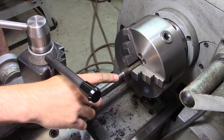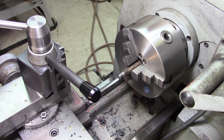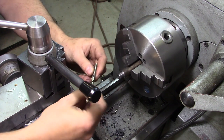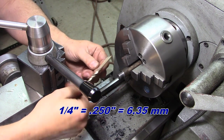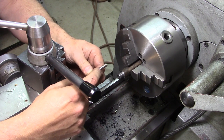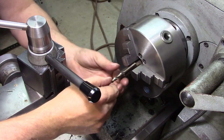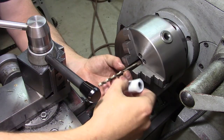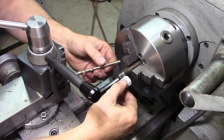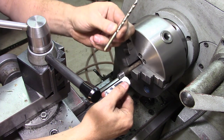The next step is to drill the center out and make space for a pilot drill. I have a few of these kicking around — they're quarter inch. It seems like a number of commercial ones use a quarter-inch pilot, so we'll do that too. We'll grind a little flat into the shank and shorten it a bit to accept the set screw. Once we get it in place it should work — get your length there, yeah, we can make one of these work.